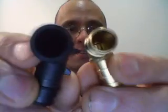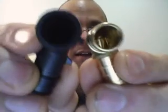The next material I'd like to talk about is Crimpex, and it has the same advantages and disadvantages that the other PEX has. The other thing I'd like to mention here is flow characteristics, because that's going to be a big topic in the coming years. There is going to be greater flow in the Aquapex than there will be in the Crimpex.